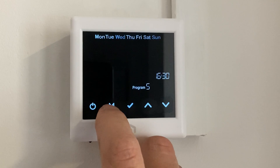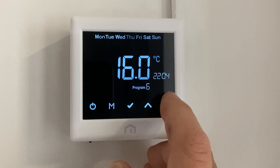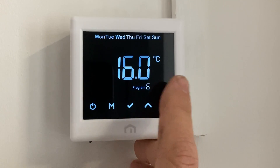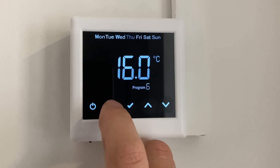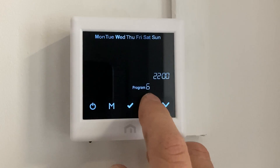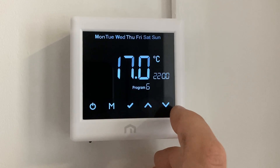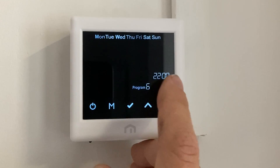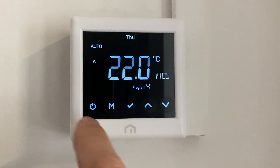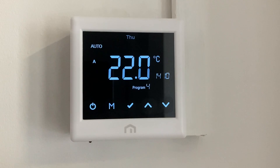So this one is still 21 degrees, and then at 10:30 at night — let's say you go to bed at 11 o'clock — first of all try your heating turning off at 10 just to see how it starts to cool down for when you go to bed. And then this temperature here will be your overnight temperature while you're in bed — we don't want that to drop too much. I'm going to do a setback temperature of 17 degrees overnight starting from 10 p.m., and that will take you right the way back around through to your morning where you want 21 degrees at 6:30 a.m.